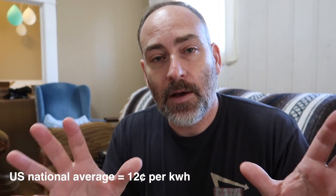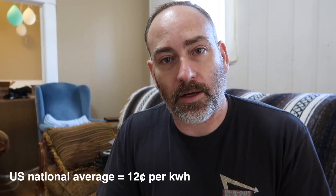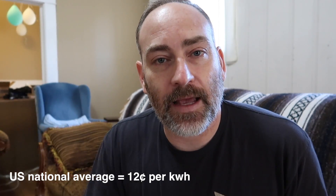As an example, say you're paying $1 per kilowatt hour — I know that's way too much — but then you would know if you ironed for one hour, you would pay $1. Similarly with the fan, it's a 50-watt fan roughly depending on which speed. If you ran it for 20 hours, you would have one kilowatt hour of power usage, the same as running the iron for one hour. Then you can figure out how much things are going to cost you to use in your house and how much money you could save by unplugging or turning things off.